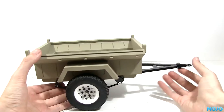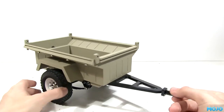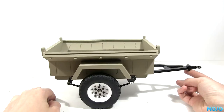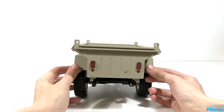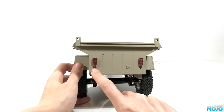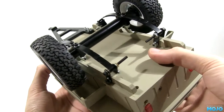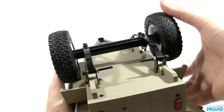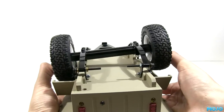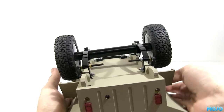Back indoors now and the next day. Here we have a more or less complete trailer. I painted the A-frame in satin black to continue the black accents from the tyres and suspension — that and it was the only other colour I had in the garage, well, that or bright blue. On the back I've drilled some holes and popped in some more LEDs: two for the indicators and one for reverse. They're not wired up yet but they're ready. I've also tweaked the moving part of the suspension — there's now a brass tube insert into the plastic frame rails to keep the shackle from wearing the plastic down. And to stop the shackle pinching, I've replaced a shoulder screw with a long M3 and more brass tube to get the correct width. The whole lot moves quite nicely now, just need to tidy up the excess thread.